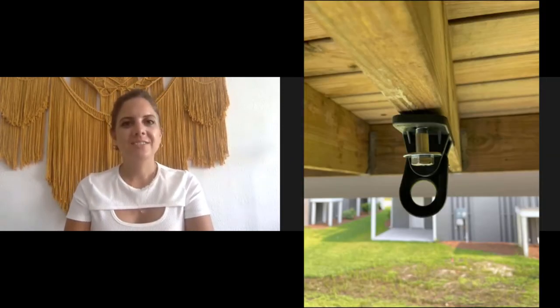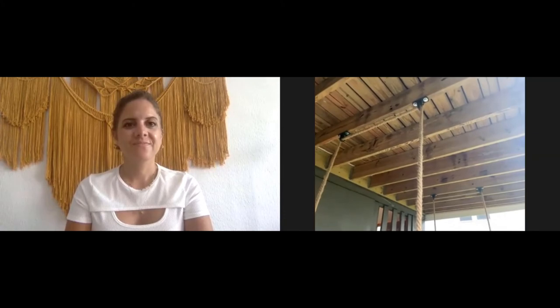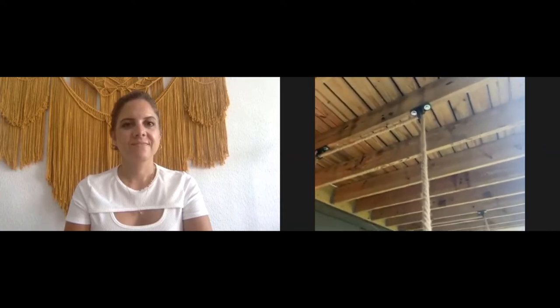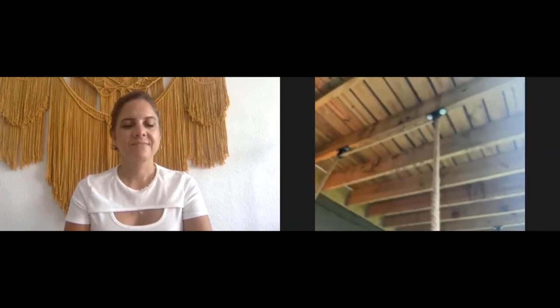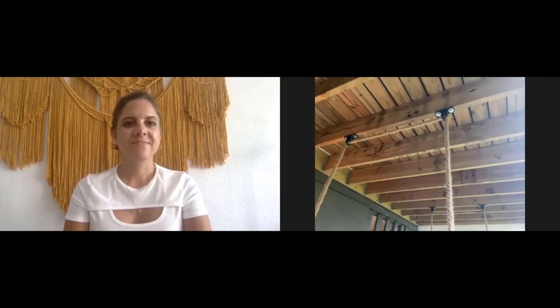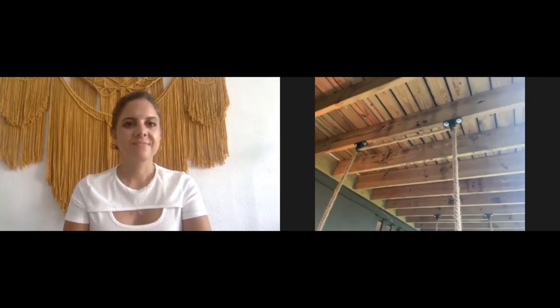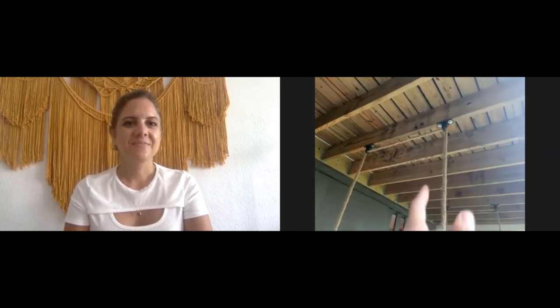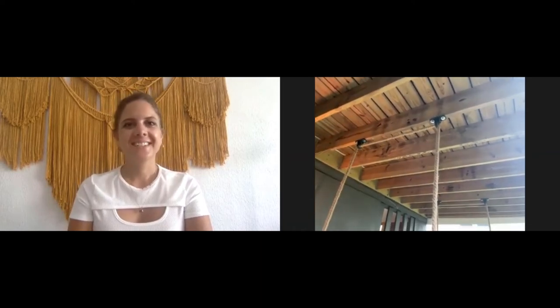They come with instructions telling you what size drill bit to use. I drilled the specified holes and then used an attachment for my drill to start screwing the bolts in, but ultimately we ended up having to use a hand crank ratchet to get more torque because the drill just won't get them in all the way — you get more leverage from a ratchet. I also got some really fabulous tips from the ladies in the Handy Women group because I got stuck. This is a hard wood and sometimes the sawdust from screwing it in gets in the way. They said take it out, use some dish soap, and then screw it back in with a ratchet — and that worked great to get the brackets in all the way.